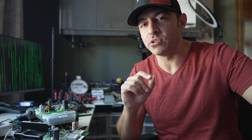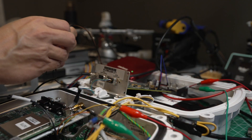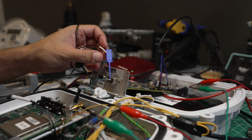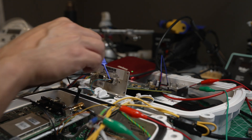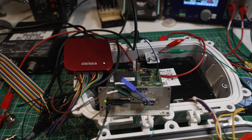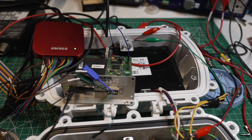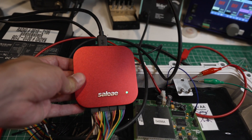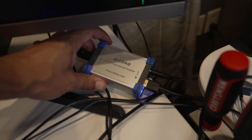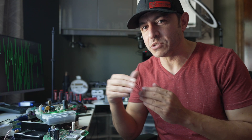It made sense to capture the RS-232 serial traffic between the PC board inside the collector and the modem board, so I hooked up my logic analyzer. I also power everything off of 120 or 240 volts so the devices feel like they're in a real environment — I really want them to think they're back where they were supposed to be. Since different things are plugged into different outlets, I use a USB isolator between my logic analyzer and my computer to avoid ground loops and prevent blowing up the analyzer.